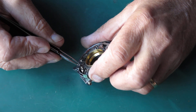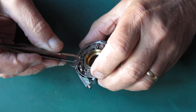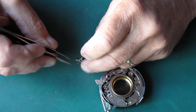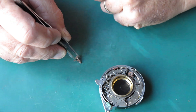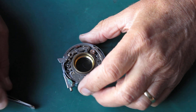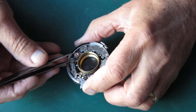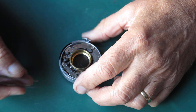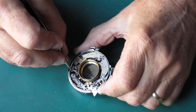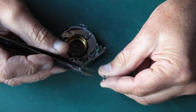That spring is sitting funny. Looking at the position of the spring on this lever, it wasn't hooked around correctly - it's a wonder it hadn't fallen off. That's the lever that stops you being able to depress the shutter release if the shutter isn't actually cocked. We'll get this piece out and the little pinion. The main spring for the shutter is here and it doesn't look like it's in awful condition - that's a bonus. Yeah, that's in quite good condition.